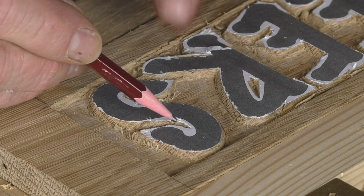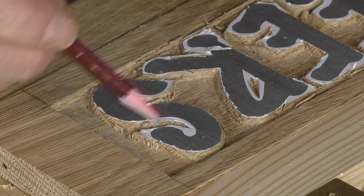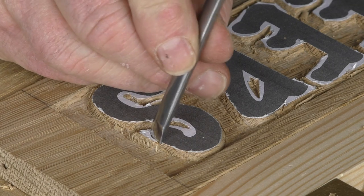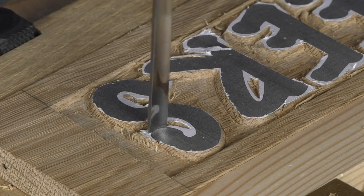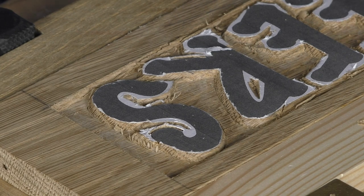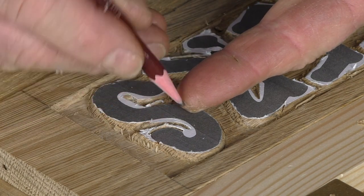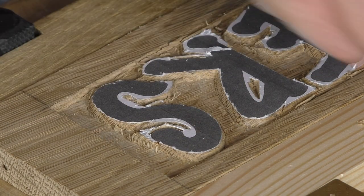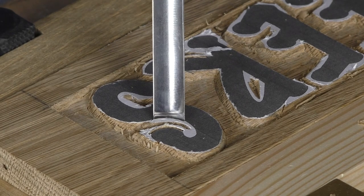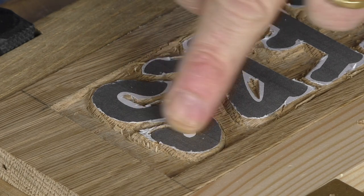Let's have a look at some of this rather intricate inside field here. I've come around the outside and I can take some of this off like so. This groove that I put in here with my V tool — what that does is it allows the wood to fall away. It's taken away some of the pressure. So when I set in here, the wood will fall into that middle section. So it's quite a good idea to do that rather than just leave that paper area untouched.